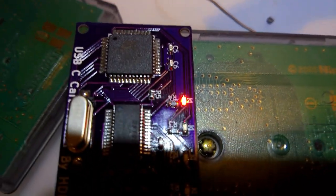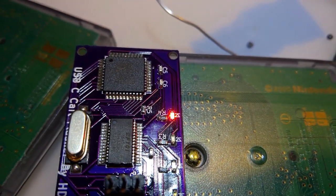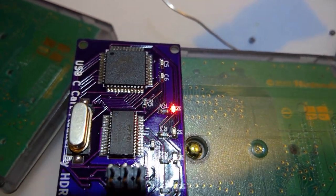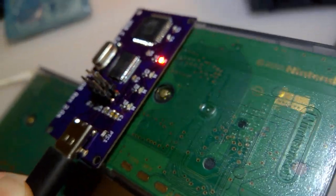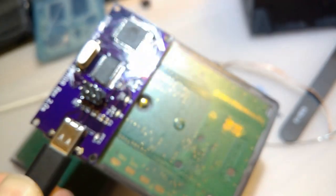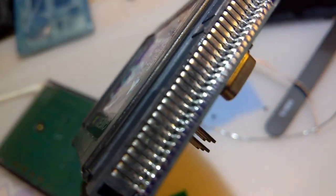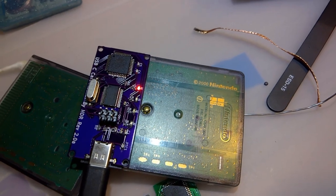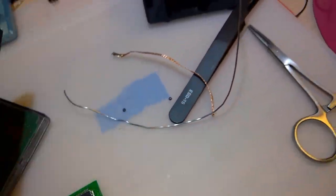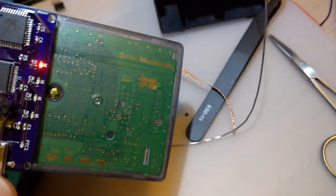It does work. The problem was, let me show you here, there was a short on two pins right here on the bottom that I didn't even see. Apparently, it wasn't bad enough that I couldn't flash the firmware. I even ended up trying to reflash the firmware, but it wasn't that. I had to solder that in because with the cart reader, I couldn't do my angled thing. But wonderful, blurry. But hey, it works now. Works great. Just make sure you don't have any shorts.